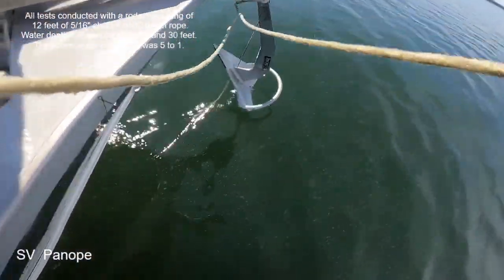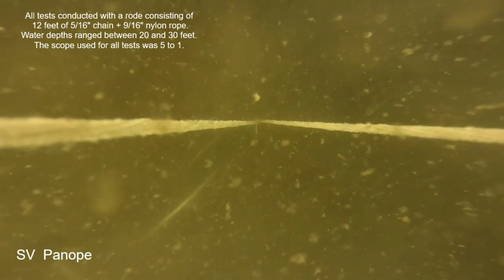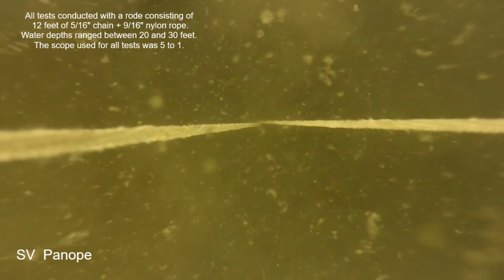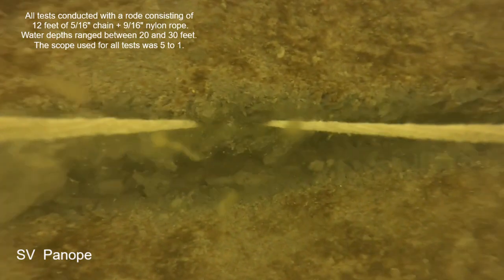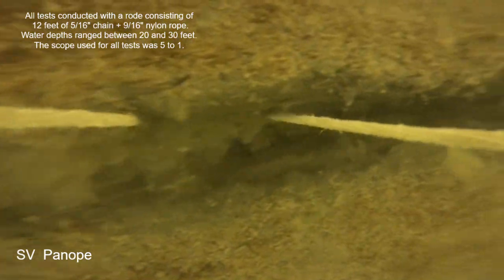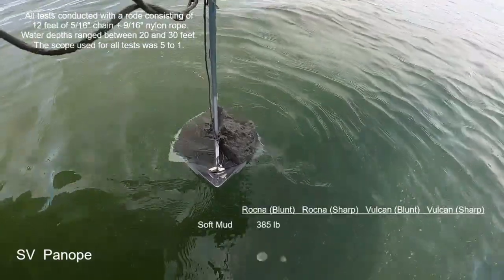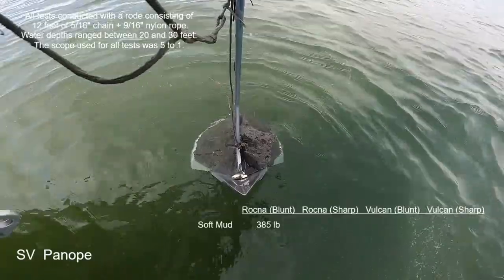So now I've got that mud ball cleaned off and gave the anchor another try. This is the standard Rockna with no leading edge treatment. This was far better holding — 480 pounds with zero on the GPS, maybe just a little bit of creeping forward. The anchor released, reset, and repeated at 480 again. Taking all three pulls — two at 480 and one at 195 — I get an average of 385 pounds. That's the rating for the Rockna with no leading edge treatment.